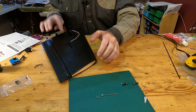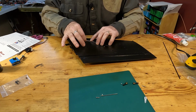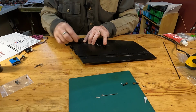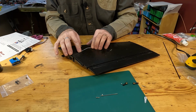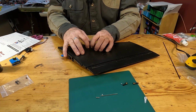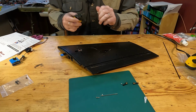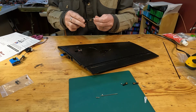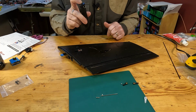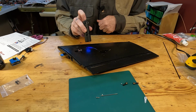I'll just seal that back up because I won't be using it. And then just make sure the wire fits through that channel, and we'll tuck this back in here so that it's a little bit more secure. Oh, that's coming out. Now in this case, I wouldn't go crazy with it, but obviously these wires are wanting to pop out a little bit. For now, I'm just going to put a very small dab of this glue. I wouldn't do this with other kinds of glue. I'm just doing this temporarily. Otherwise, use a piece of tape for what I'm doing right here. I just happen to know that this will come off very easily. Just use tape otherwise. And that's just so that this doesn't keep popping out as we work on it.